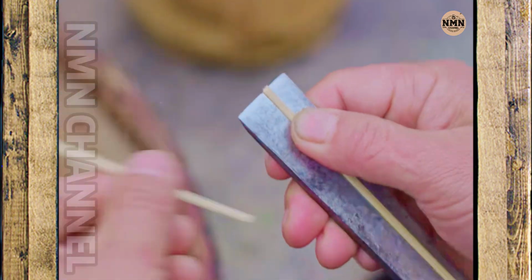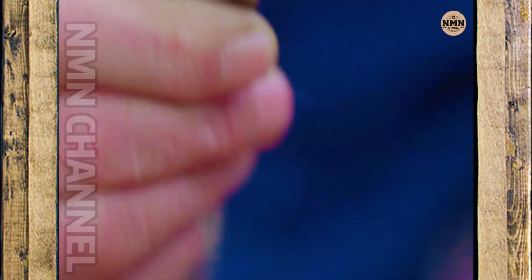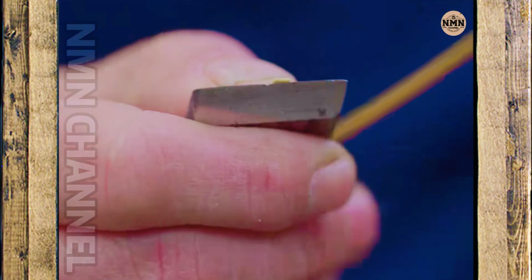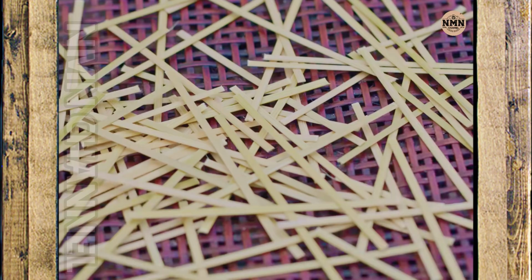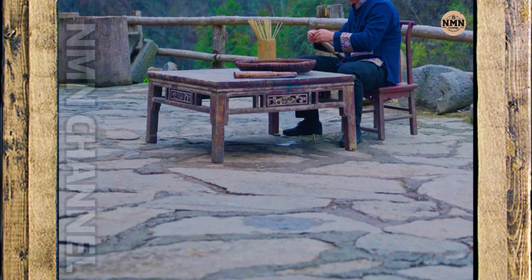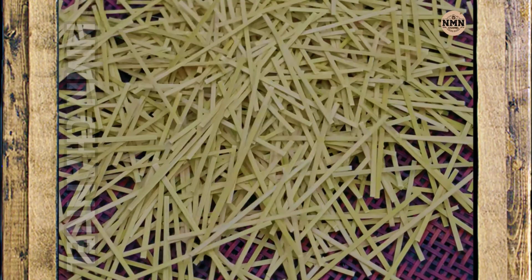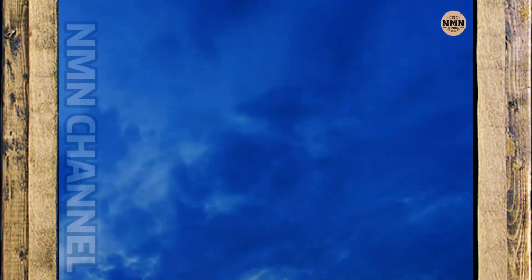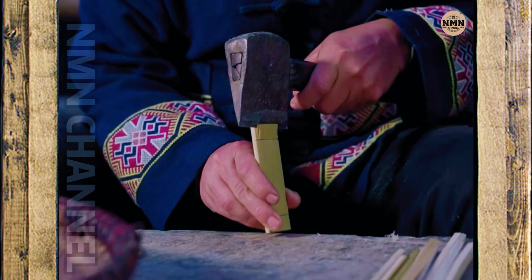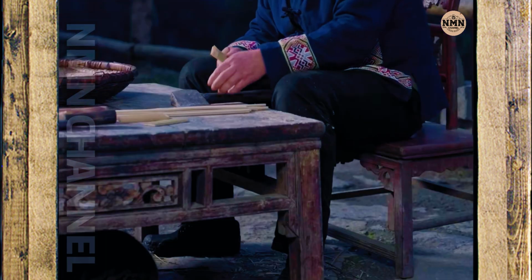After being polished, each small bamboo stick is broken in half and divided into the desired size. This is the preparation step to create the vertical slats, an indispensable part of the bamboo weaving frame. The worker continues to cut and trim 2 thick bamboo strips to the exact size. These are the beginning and end of the bamboo frame.